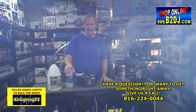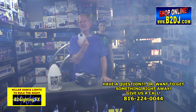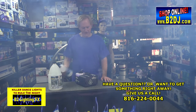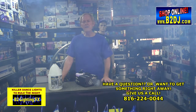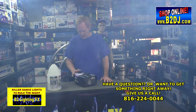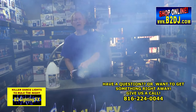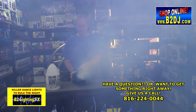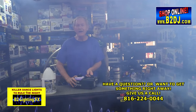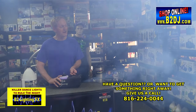Fog cleaner? No, I don't think so. Everybody sells this stuff — American DJ sells it, Chauvet sells it, everyone sells fog cleaner. But you can just go to the store and buy regular white distilled vinegar — that's all you need. We have a clean fog machine — the Hurricane 1200 — cleaned with an $0.88 bottle of vinegar. That is pretty awesome.